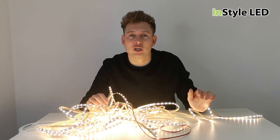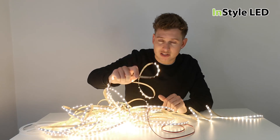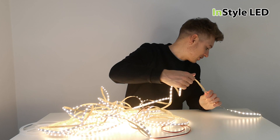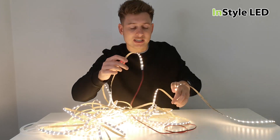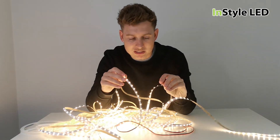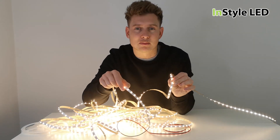Powered from one end with only around 20% light loss towards the very end of the 20 meters — so that is the worst case scenario. From the start of the LED strip to the end after 20 meters, the light loss is around about 20%, which in some cases is completely acceptable.